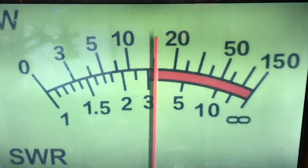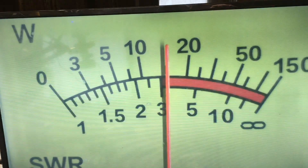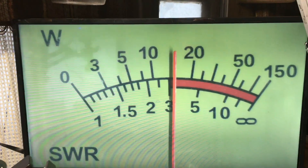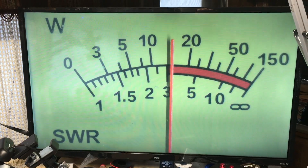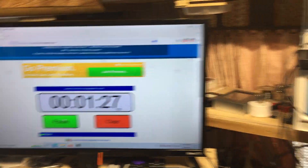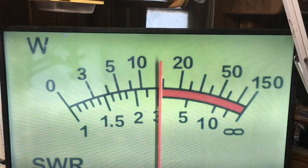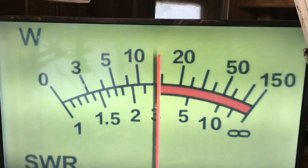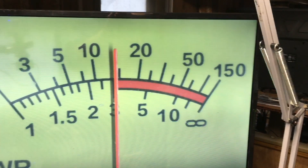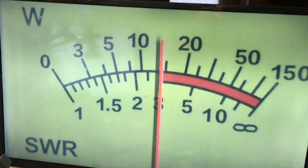And there's the proof right there. We're at around 15 watts — that's at one minute key-up, which is not really long. If I let it go it's going to keep dropping. We're at a minute 27 seconds and that needle's moving off the 15-watt mark. So there you have it — if you're running more than 10 watts into that duplexer, you're probably losing wattage. At least with mine it's dropping fast.